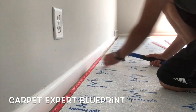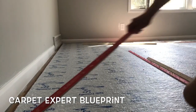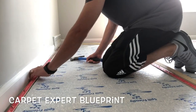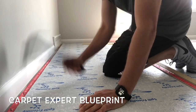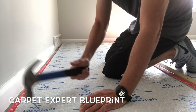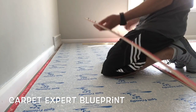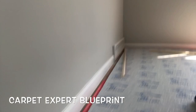You may be noticing that the carpet padding is already down. This is because Prestige Carpet got to the job site before I did — I had all the tack strip and he had all the padding. Rather than sit around and lose time, he went ahead and started padding the room, cutting a channel out around the room so I can just drop the tack strip in place.